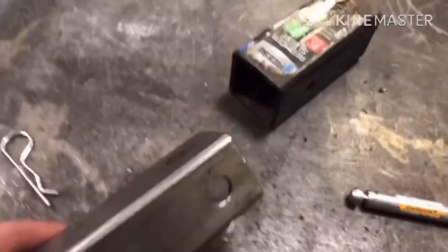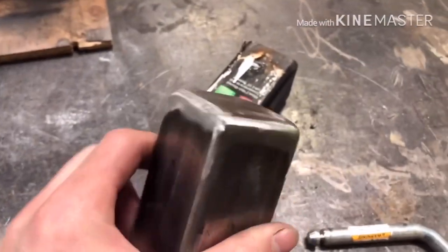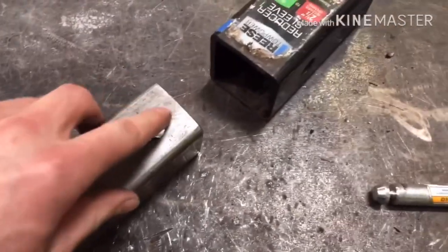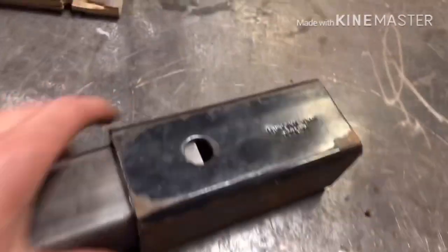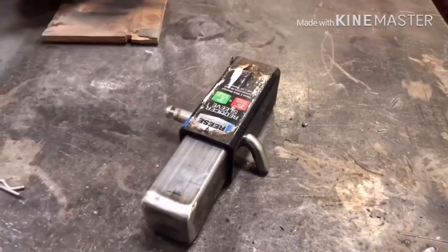Here's my two and a half by two inch adapter for the trailer hitch receiver, and here's my square tubing piece. I drilled out the holes five-eighths to match so the pin fits through, put a cap on the end and rounded it out. It'll look better once I paint it. Goes right in there - didn't need a lot of material in the back because it's not going to take any weight. It's not pulling a trailer, it's just gonna hold a flagpole. I'm gonna weld the piece of pipe right here for the flagpole next.